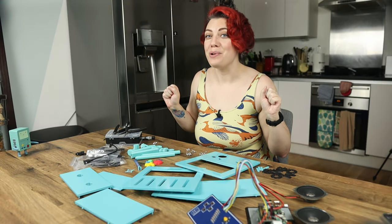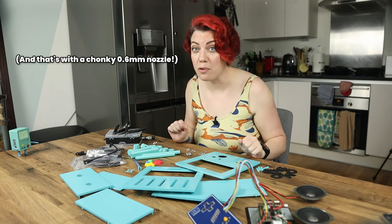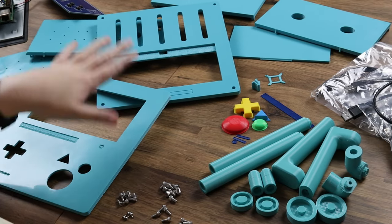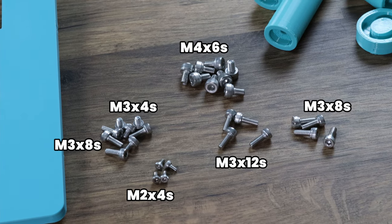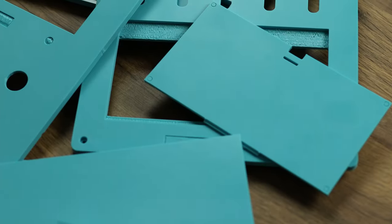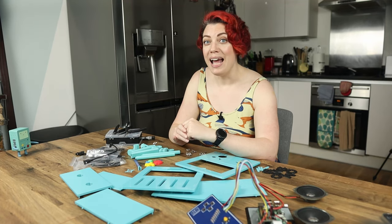At long last, all of my precious prints are finished. Be forewarned, this is not a fast project to print — not including the things I decided to print on my tiny 0.1mm nozzle just to be fancy, all this took an accumulative 60 hours to print. That said, there aren't actually that many pieces to this, and they were largely very easy to print. The build also requires a handful of M2, M3, and M4 screws to secure everything together — no complicated assembly, no niche tools, no big mess. All of the major body pieces I printed in PETG, taking full advantage of Polymaker's trademark teal color. The buttons were printed in various PLA colors, and the limbs were all done in Polymaker Polyflex 90A Shore TPU. I highly recommend PETG for the body, as it won't deform around hot electronics, and its flexible strength is quite handy in these kinds of builds.